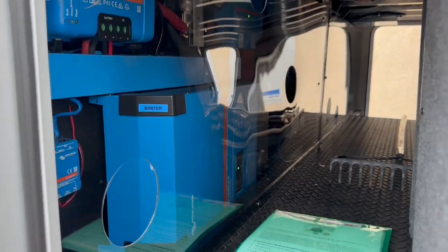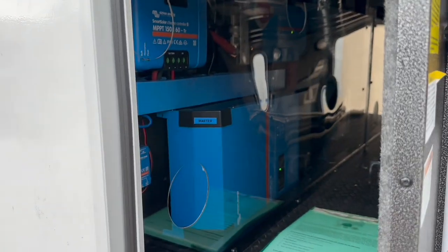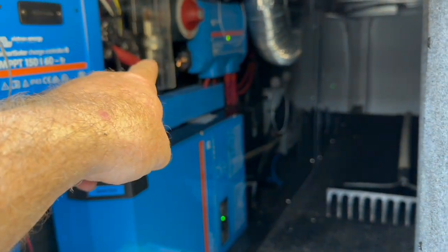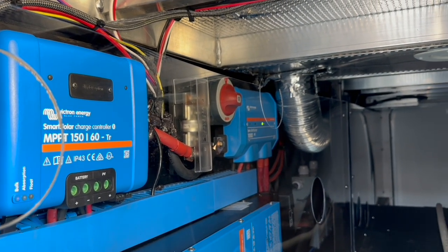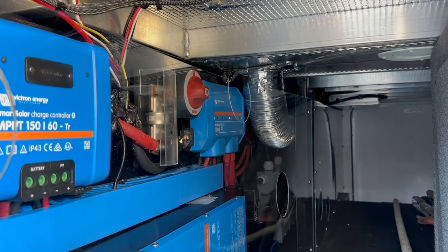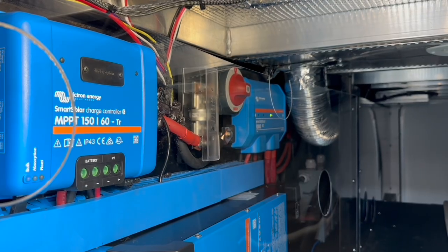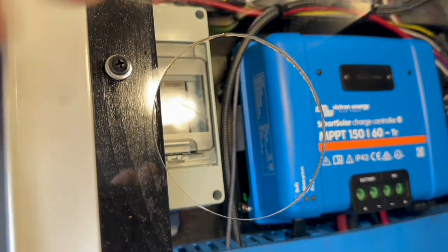We think we've done a really nice one here — saved him all his space. This is exactly what he had before but we took that wall out and pushed it all inside. On the left street side we've got our master inverter. Up here we have four-aught cable coming from the battery bank on the positive side, going through a Class T fuse, then the BEP master cutoff switch rated for 400 amps continuous, into the Lynx distributor. We've got our MPPT 150/60 — 1800 watts of solar on the roof, which is good for about 1780 watts at 24 volts, so we've maxed it out. He's got a shutoff breaker for his solar as well.